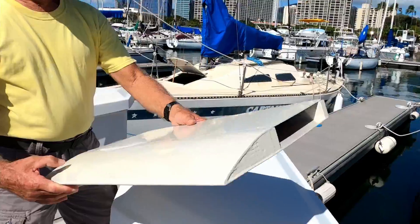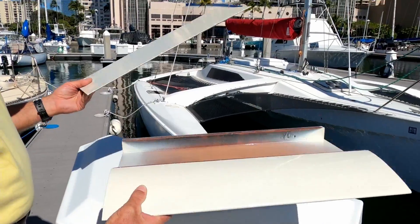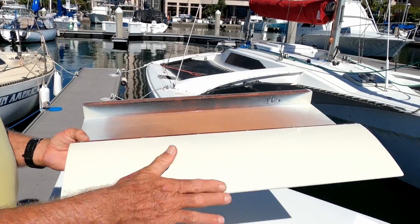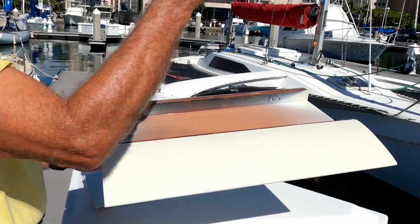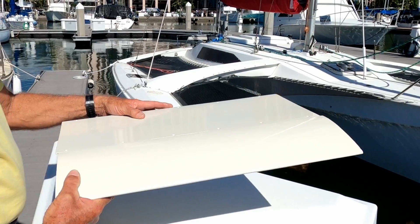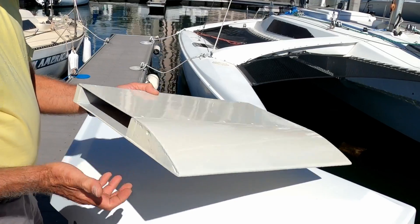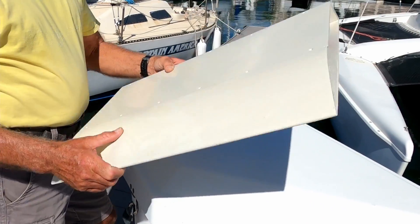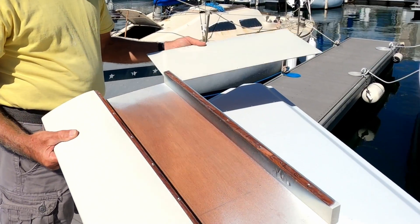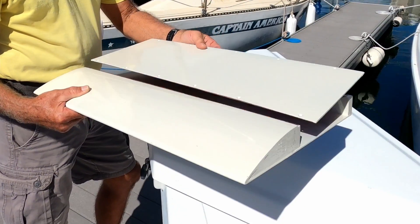This is the finished tab. You just load it on the strut — two struts run in here. This fares the water that would normally hit the strut and blow it straight up. This just holds it on. And what kind of material did you use? This is just three millimeter ply — blasted on the outside and epoxied on the inside, with some one-by-twos. That's it.